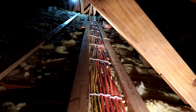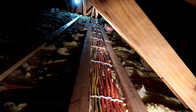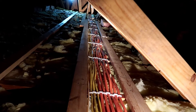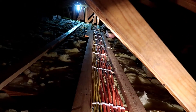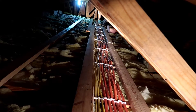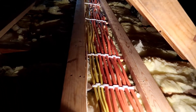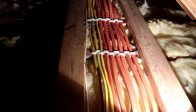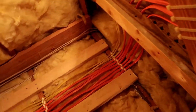They came out to about 57% fill. The six 10-3s punch up through the closet ceiling — they're at the far end of the house — and now they run along the trusses; I stapled them on every truss. The conduit that comes out of the closet ceiling has all the wiring fastened within 12 inches of the opening of the conduit.